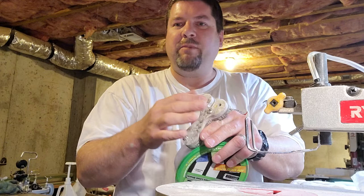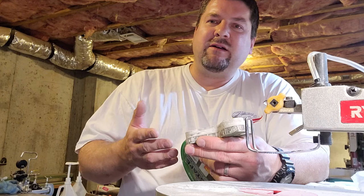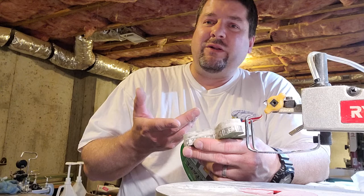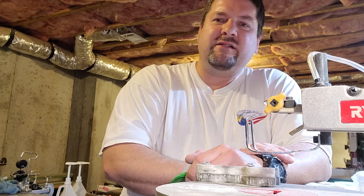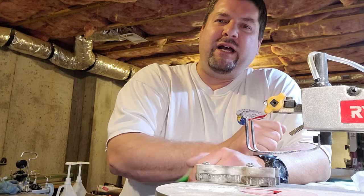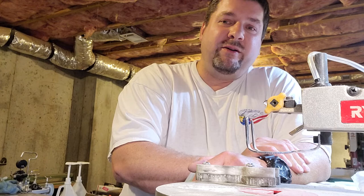Now that sounds completely contradictory — I mean, it's tape, it's supposed to stick to stuff. But if you look at painter's tape, you notice how it just barely sticks so that you can remove it without causing problems. It's lubricated a little bit or has some anti-stick in it to reduce the stickiness of the glue. Surprisingly, you put it on the bottom of the aluminum. In my case I put a layer between the template as well. You don't have to — if you have a template drawn on, just put packing tape on top, which is clear and see-through, and it lubricates it. You don't even have to use oil; you just slowly feed it. Do one pattern without the tape and one with the tape, and I'll tell you what, you'll notice the difference. I was blown away — I never would have believed it if I hadn't proved it to myself.